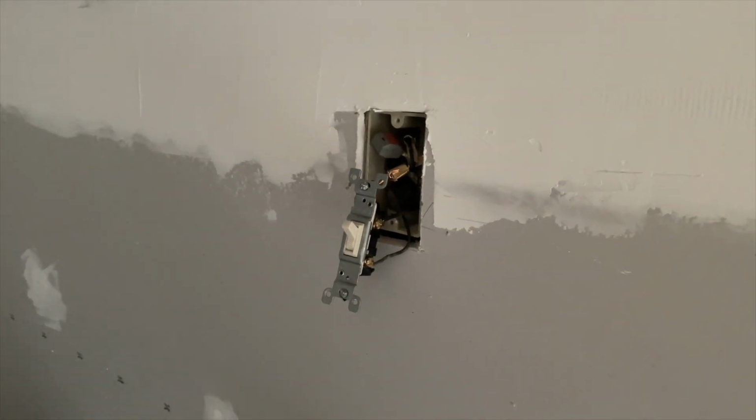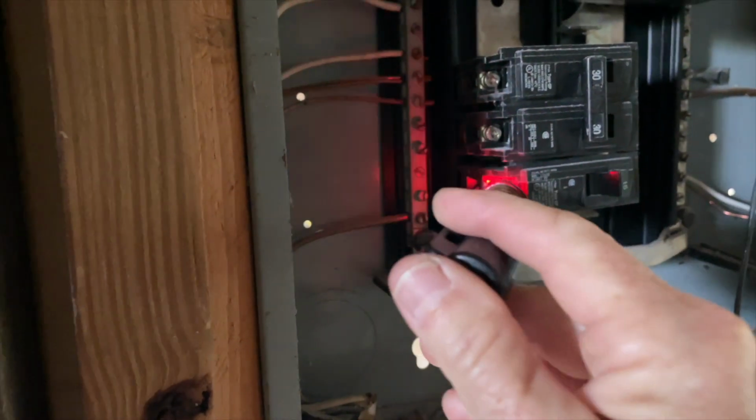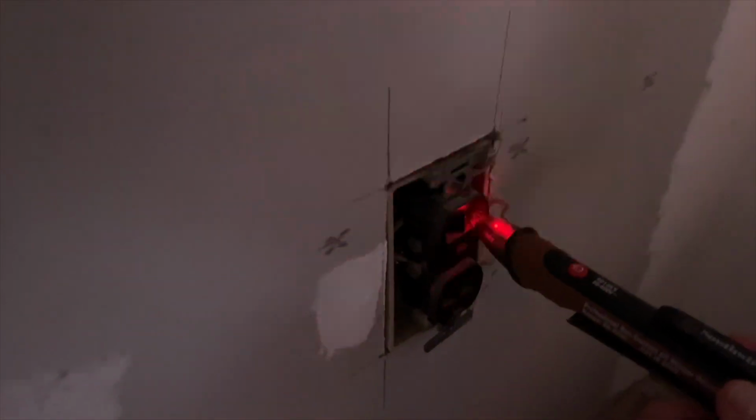So, I was doing some testing, and I thought maybe this old switch was screwed up. This is a new one. I just bought it. Aha. I had hot on the last switch, but I didn't have hot here, so that was a problem. I tested the breaker that is over here. That's the breaker for it. That's working. And I'm sure if I go up there and test that, which I will, once I get rid of the tools off the ladder, but it leads to over here, which, voila, wonderful, and to this switch, which is hot. Turn on the switch to the light.